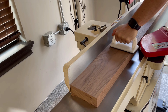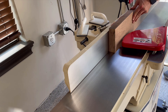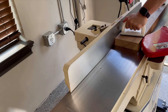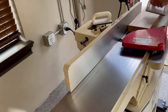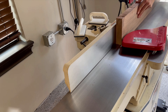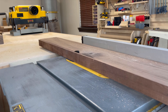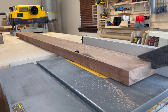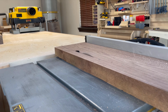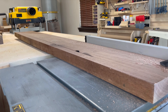This next part was relatively straightforward, especially since I've been doing a lot of desks and tabletops recently. I took some longer pieces of walnut, ran them through the jointer to get two straight edges, then planed and ripped them to the right width. For the bench top I'm gluing up three different pieces of wood together and putting a nice angled edge on either side of the long sides to get the farmhouse design look I'm going for. There was one particularly large plank from which I cut an extra thick piece to use as a cross member in the leg construction.